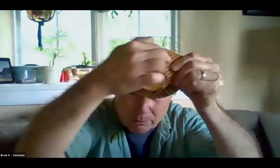And then for this challenge on Tuesday, I took a plank of freshly cut white birch and made two depressions in it, one oval, one kind of round. So the roundish one I made with little wings on the end grain, and then I textured the outside with this little gouge. And I tried to go for some kind of geometric pattern. And I wish I had done more of this, where you go one way and then the other way. Yeah, like a herringbone kind of thing. I did that on the four corners.